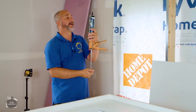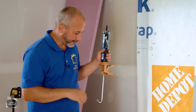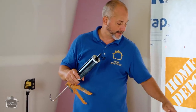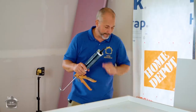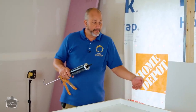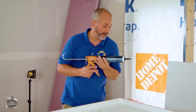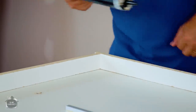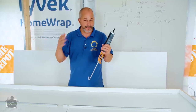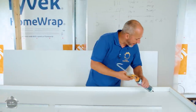Now the purpose of the silicone actually does two things. One, it seals the joints, okay? So that the raw exposed edges of this melamine can't absorb water. Two, it creates a rounded edge that when you invert the countertop, it's a nice soft round edge on the top of the counter. Nothing wrong with having a nice soft round edge. And number three, it holds it all together. Silicone on melamine has much better bond strength than hot glue. Still not amazing, because when you take the countertop off, it'll just peel right out. But it is a little extra added precaution.